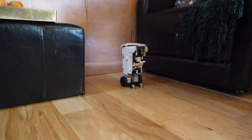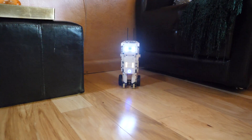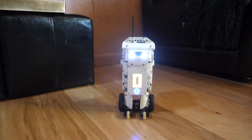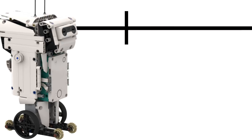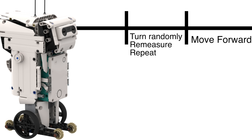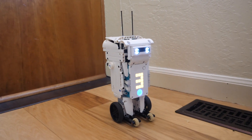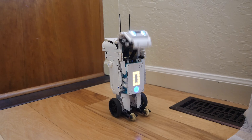It is just a single ultrasonic sensor. So how exactly is it able to distinguish the difference between a regular wall and your hand? I'm very proud of this program. Basically, once you start it, Neptunian will measure the distance. The distance is divided into thirds. If the ultrasonic sensor reports seeing something in the last third, the robot will keep moving forward. If he sees something in the second third, he will randomly turn either left or right, re-measure and divide the distance again, repeating the program. Finally, if the robot sees something in the first third, he will activate the shooting mechanism. To put it simply, the robot avoids any expected obstacles while firing at the unexpected obstacles that suddenly appeared in front of the ultrasonic sensor.